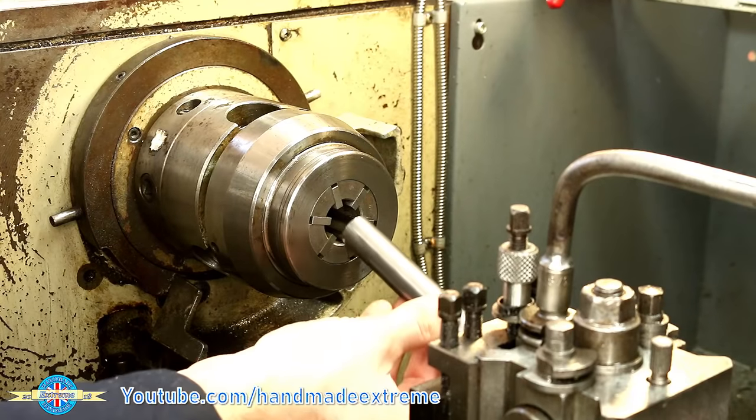And there's a close up of the business end. So let's give it a go — this is some 100mm wide, 4 inch wide by 3mm thick, about an eighth of an inch, and this is about the size material I actually built it for. And that's no problem at all, gone through really nicely. I think it wouldn't have any trouble rolling that up into a full ring. We've also got some 6mm thick aluminium, about a quarter of an inch, and that's rolling up into a full circle — no problem at all, nice and easy. You can see that little bit of play in the frame as it rocks back and forwards; I'll see how it goes and shim it if I need to. And let's give it a challenge — this is some 50mm wide by 25mm high by 3mm thick, that's 2 inch by 1 inch by about an eighth, and I think that's about the max that it'll manage.